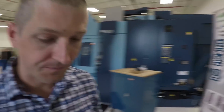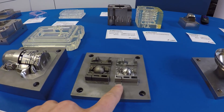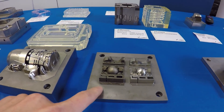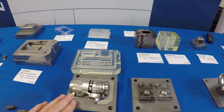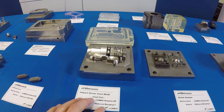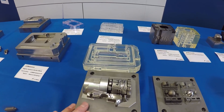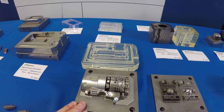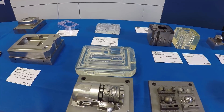That's really cool. Here we see one example where they did the machining, and this is the one where they left it as just 3D printed, just as a comparison. When it comes off, this material is similar to H13 tool steel and is about 35 Rockwell. Putting it in an oven at 460 degrees C for about four hours brings it up to 53 Rockwell.